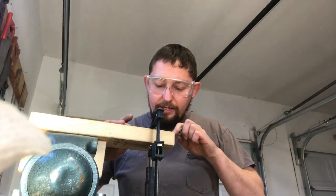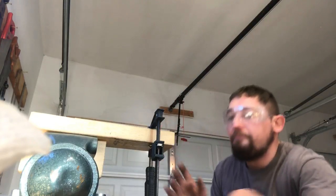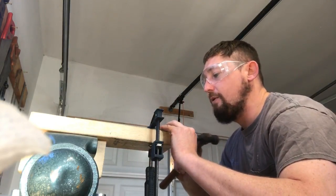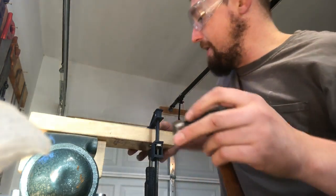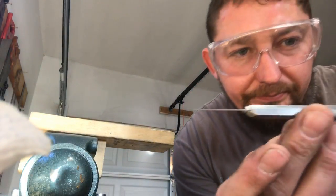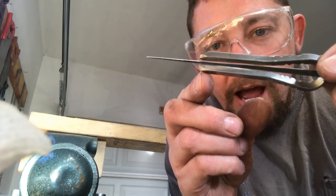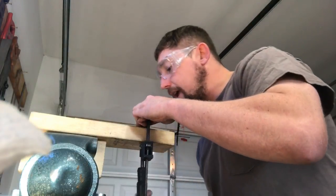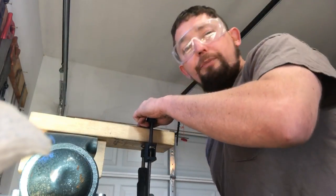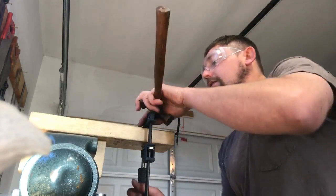We'll slide this in. Well, that's better. Give it a couple taps. Before I crimp it, I want it like a puzzle piece. Okay, we're sitting about where we want in center, but if we look at it, it's pitching off to this side too much. So I can apply a little bit of extra pressure and see if I can get that reed to turn. If not, it means I need to correct my channel. Oh yeah, here it goes. Bit of pressure here.